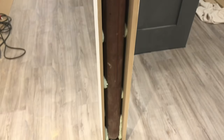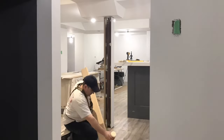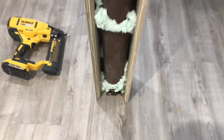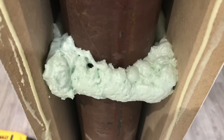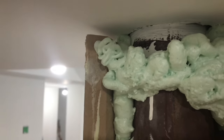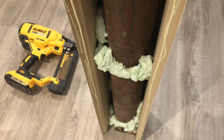Let's go put the other cap on. Here's the other one — it's all dried up. Solid as a rock. The cap's right here and it's all beveled. You can see how I built these in our other video. I'm going to glue this all the way down and then put brad nails on there. This is basically what it looks like with the foam just before I put the cap on — just enough foam to fill in the corner to support the cap. Once this cures it won't move.